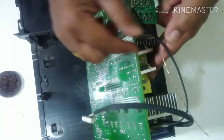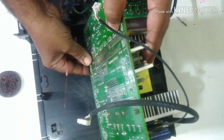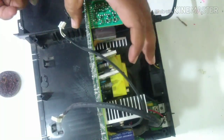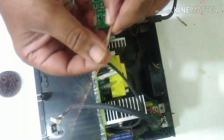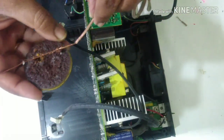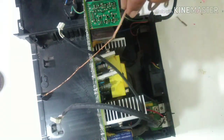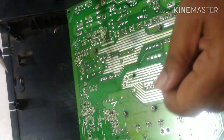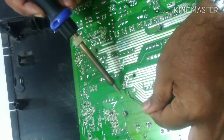This morning I am finding that my desoldering wick is done, so we will do a small hack to create one. I have a copper wire here — I will put some soldering paste into it and then use it as a wick. So first let us desolder the capacitor in question.